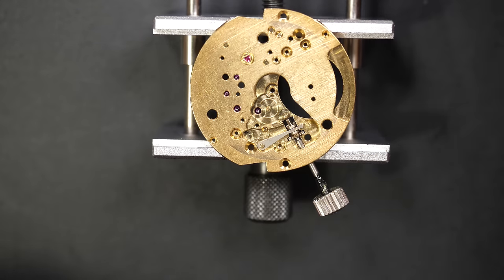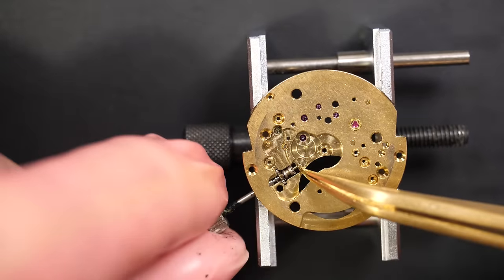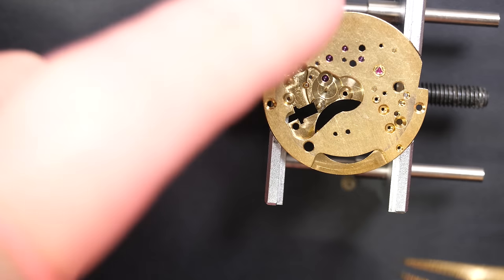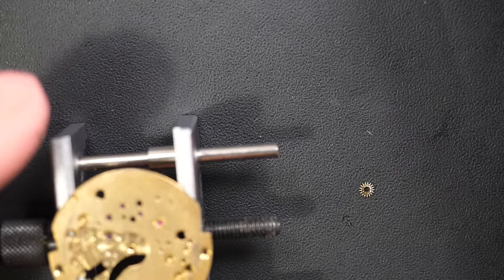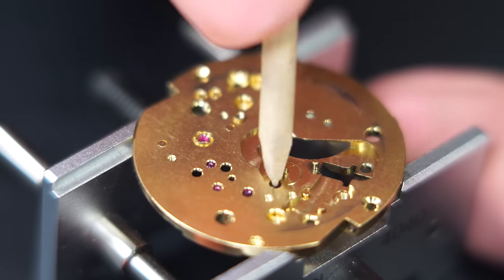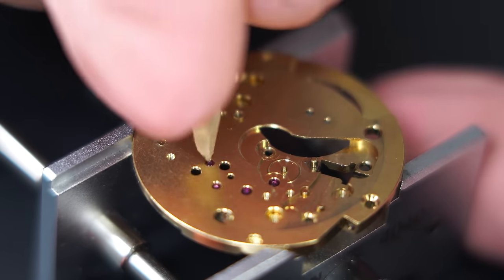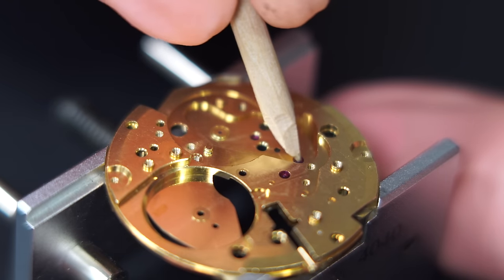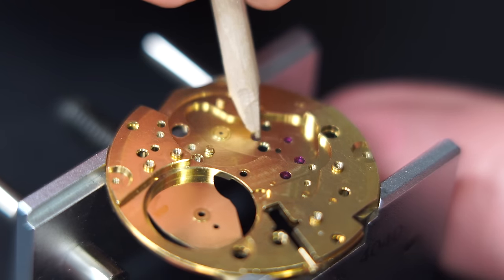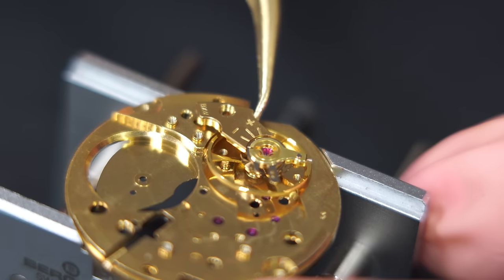Removing the yoke spring — always a strong spring. I notice the yoke spring was the other way around: the small side was on the yoke when normally the long side goes on the yoke. That's strange. The last parts are the clutch and the winding pinion. Now cleaning the jewels with a piece of pegwood, just to make sure there's no dried-up oil or grease. The movement is quite clean, but it's worth the extra effort before putting it in the washing machine.